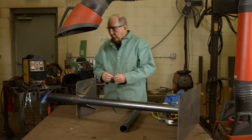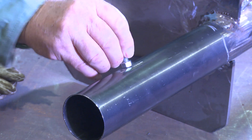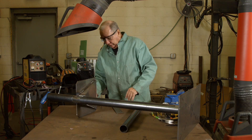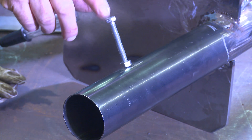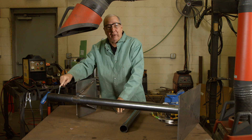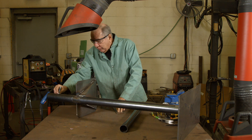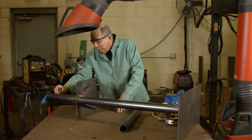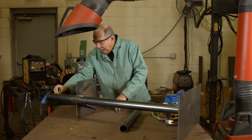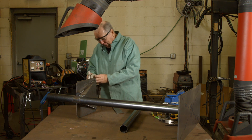Alright, step one: what we're going to do is tack weld this nut to the plate. To hold it in place, I'm just putting the screw through there right off the bat, sticking it down in there, and then holding it in place while I tack weld it. I need to point out from a safety consideration — of course you always use your safety glasses and all that — but sometimes these nuts and bolts are plated with materials which can be hazardous when you weld on them, cadmium plating for example. So you want to make sure you don't breathe those fumes. Some of you guys have complained in the past that I don't spend much time talking about smoke extraction. Part of that is because I don't anticipate somebody doing this on an industrial level day in and day out — it's just a quick weld here or there — but because I've gotten some complaints, I've gone out and bought a $3,000 smoke extraction unit. So with that being said, let's tack this in place.